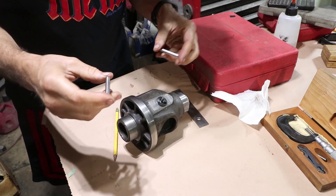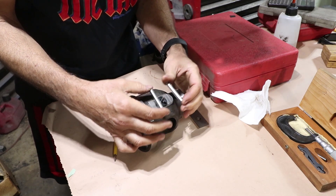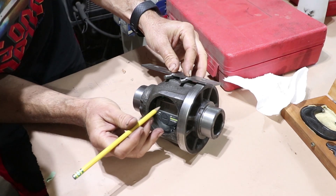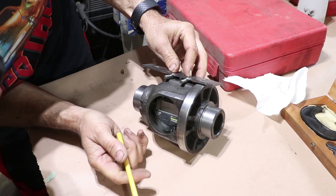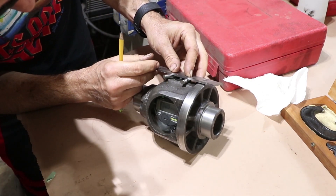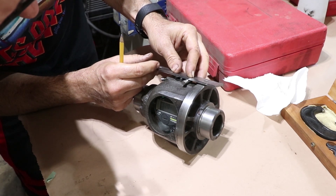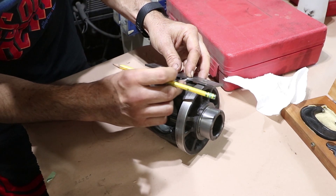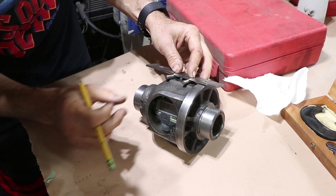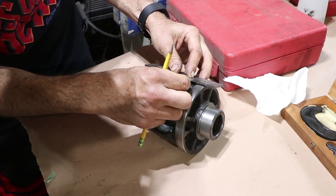After a bunch of math I've determined I need a height of 0.2678 inches. I have a 0.268 and 0.267 pin, and I'm going to place them on either side. I just hit zero on the indicator, and now that indicator is nominal 59.8mm. No matter where I put these gauges I'm getting the same zero reading, so this isn't fluctuating at all — which means the surface I milled here is parallel and everything is good.